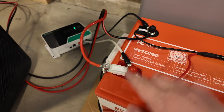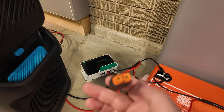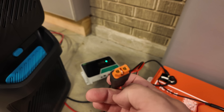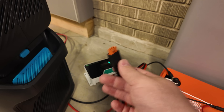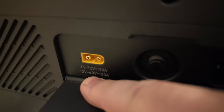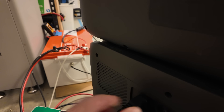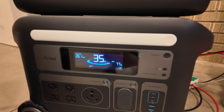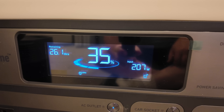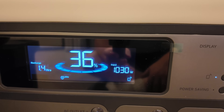I've got multiple things hooked up, but notice I've got a fuse right here — that is fusing this cable. This particular cable has an XT60i connector on it. You can get different ones; definitely get the ones with 10 gauge cable. The Anker F2000 is rated for up to 60 volts and 20 amps. So we're going to simply take this cable and plug it in like that, and what's going to happen is the power station is going to recognize that as a DC power source and start charging. And there we go — look at that: over 1,000 watts of input.